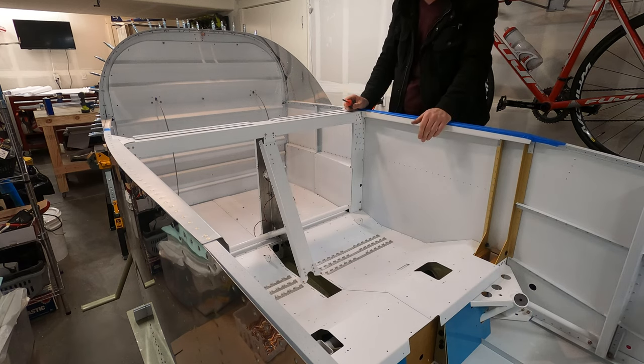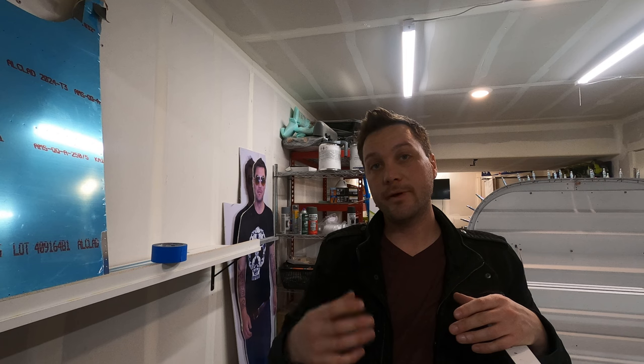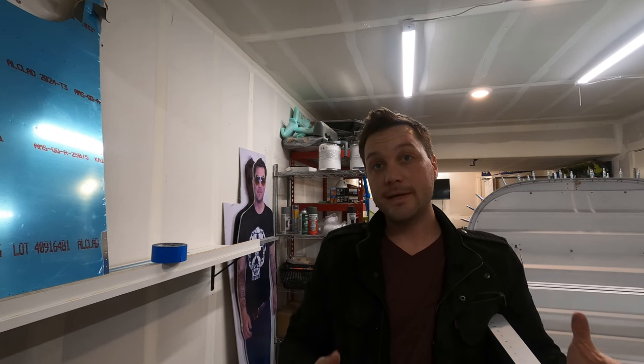The flap system is almost entirely installed with screws, and this is good, because as I alluded to, it might have to come out. In fact, nearly all of it's gonna have to come out just for wiring. But why might the rest of it have to come out? The RV7 is set up with just a simple toggle switch for flaps, and you count in order to deploy or retract your flaps. A count to three, for example, might equate to 10 degrees of flaps. I have very little faith in my ability to both count and fly at the same time.